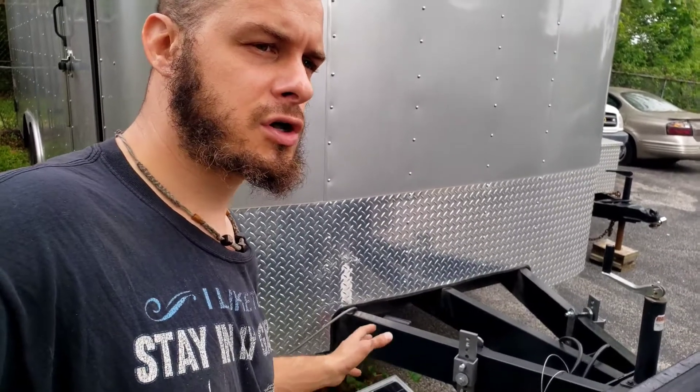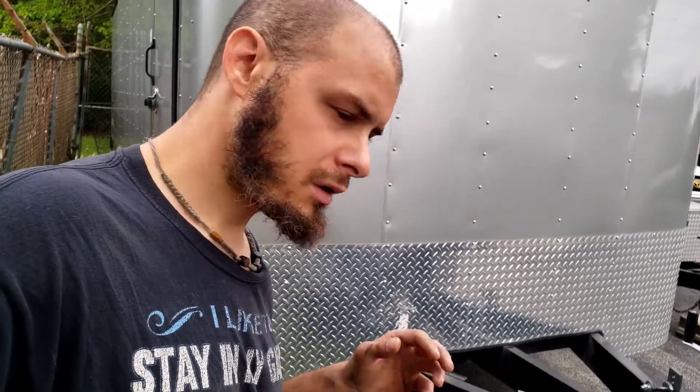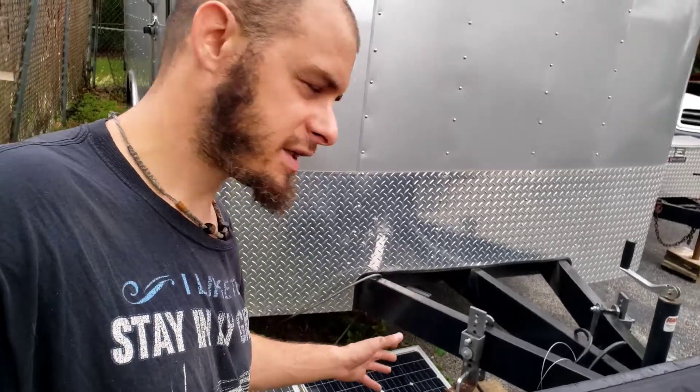You also need kill switches, fuses, and all kinds of things — and the wires are really not cheap. Here's a big misconception as well: you have to mount your solar panels closely to where you convert to AC, or close to your battery bank. DC is very inefficient over distances, as we know from learning about Edison.